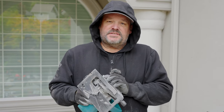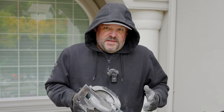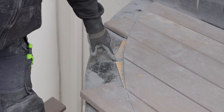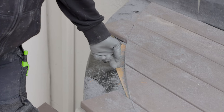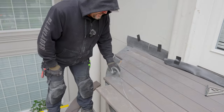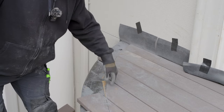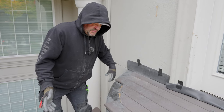This saw is set to just a little bit past one inch, so it technically does cut through the decking. How do I not cut the bladder? Well, if you look over here, I have some door skins that I've ripped down into about two and a half to three inch widths, and I put them underneath my cut line that I'm about to cut the curve. This allows me an eighth inch of play in my blade thickness so that I can cut through the decking and cut the boards.